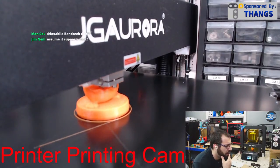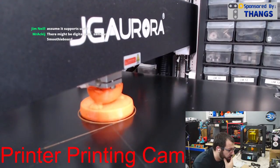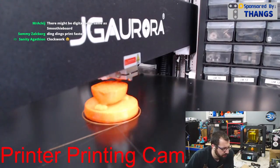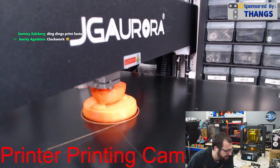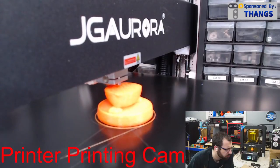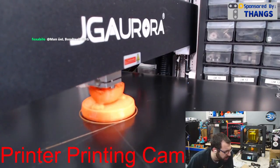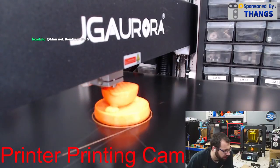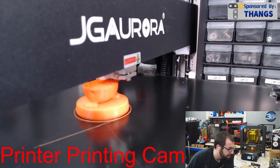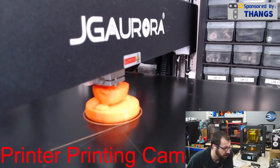So it's a drop-in replacement for an A4984, proprietary adaptive, low RDS on output, single supply, microstepping up to 32, full torque step mode, short to ground, low current sleep mode. Applications, video security cameras. Yeah, I don't know if I can adjust the current in these guys. There's no microstepping or anything. There's no pins or anything. So it might be just kind of you get what you get in terms of motor current. 35 volt cap. So this thing can only take up to 24 volts, but it is a 24 volt board. So it should have no problem running Klipper.